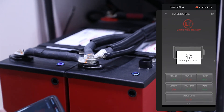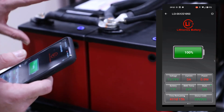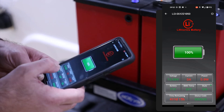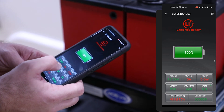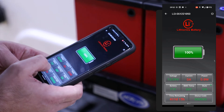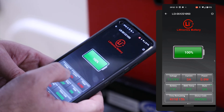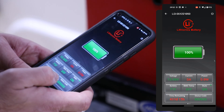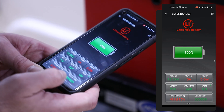Once you locate it on the phone, you'll select each battery individually — the app goes into each individual battery, it does not view this as a battery bank. Inside, you can see the current voltage. Any current load shows as a red number, meaning you are drawing from the batteries, while anything in green shows the batteries are being charged. This particular one is at 100% right now with no load. You can also see battery temperature and roughly how much time you have left based on the current state and load.